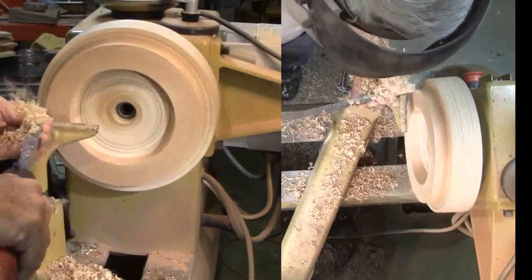Then I tried to figure out how to glue my three sets of rings to the top ring. Remembering my circus act in gluing the individual rings, I only glued one at a time this time. I did spend a lot of time trying to optimize the slants of the three sets. With the last block of rings glued on, I flattened the bottom so it could accept the base ring. I wanted the base ring to be a full ring, but in retrospect I should have glued the base on cockeyed anyway and then flattened the base — it would have looked better to not have a partial ring just above the base. Then I glued on the last ring for the base. I had pre-glued the base ring to another threaded wood faceplate and a waste ring.